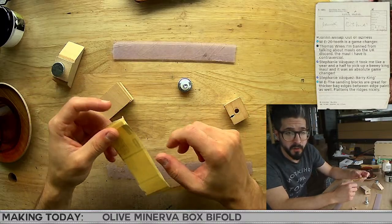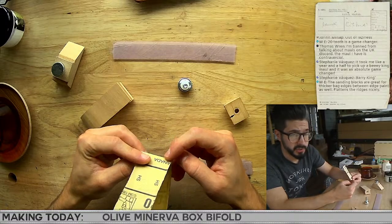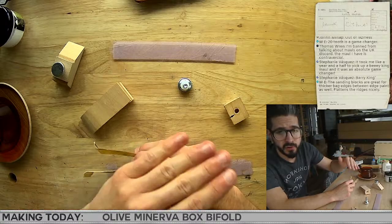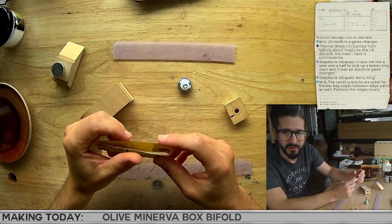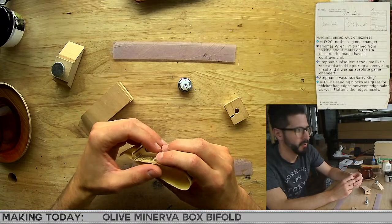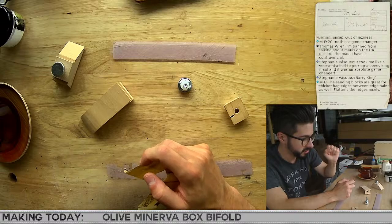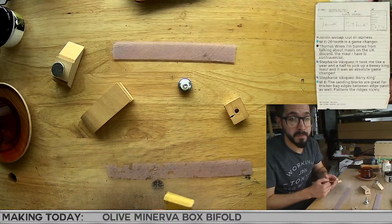That's my personal preference on it. Edge paint as well, and actually in particular even edge paint, when you want to take it down, because everybody who does edge painting knows about the valley, the ridge that you get when it dries in certain kinds of weather, you'll get that little valley in there. If you want to cut that, use the block, because if you use your hand, it will just follow the shape of the paint.